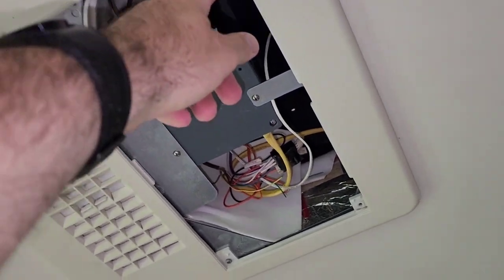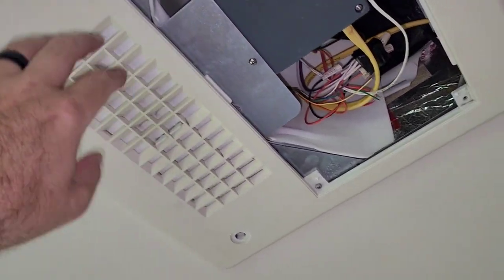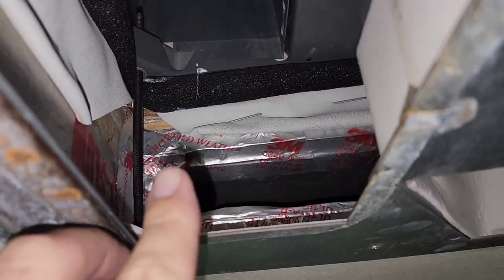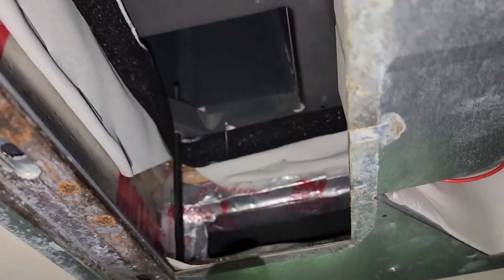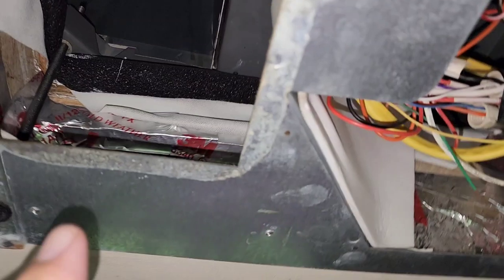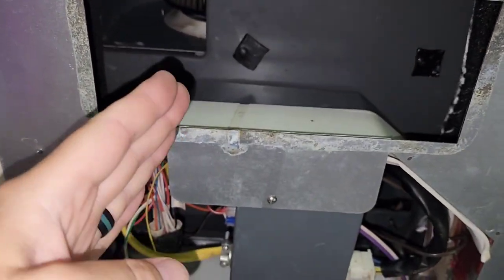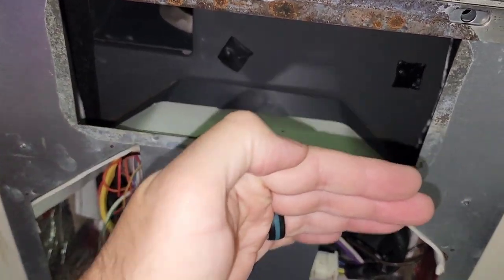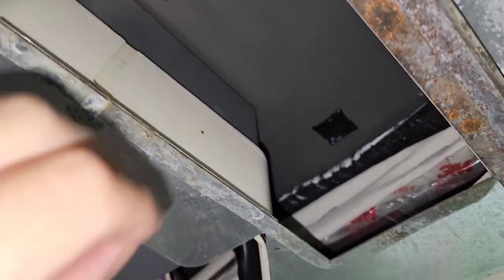So I've got to pull these screws down — looks like three left. Let's see what this looks like. This is what I got. I already went here before and kind of sealed that up months and months ago last year, and it worked a little bit better. You can see the forced air is only on one side of that opening, so I'm going to have to make a V right here and then really angle that one down.